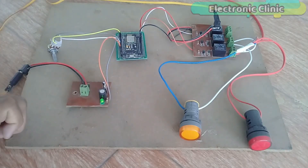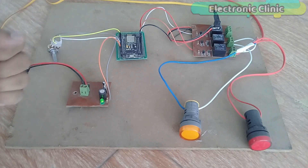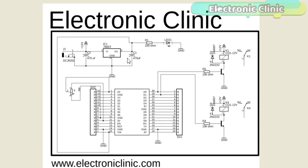The components and tools used in this project can be purchased from Amazon; purchase links are given in the description. This is the 5V regulated power supply based on the LM7805 voltage regulator, which will be used to power up the NodeMCU ESP8266 module. Two 470uF capacitors are connected at the input and output sides of the 7805 voltage regulator. A 330 ohm resistor is connected in series with the LED as a current limiting resistor. J1 is the DC female power jack, where we connect a 12V adapter or battery.